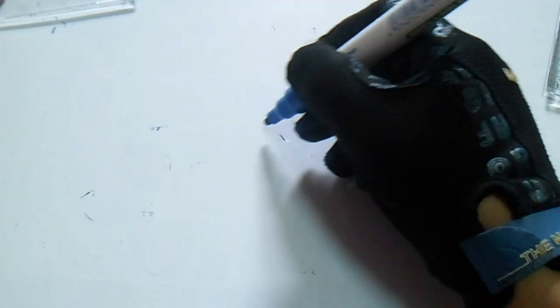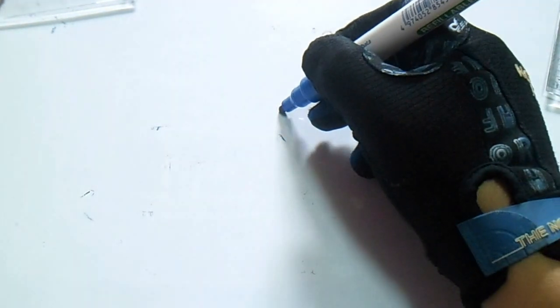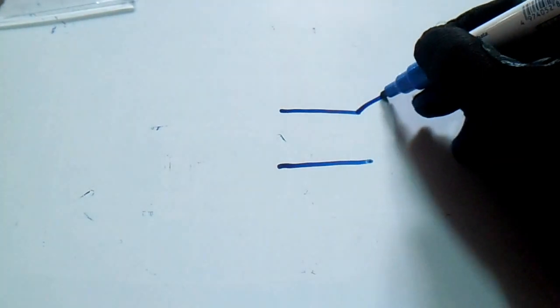If we have a flange, the alignment is very accurate. Sometimes you have only 1 mm or zero mm tolerance for the alignment of the holes, because this is important when attaching from the front — zero tolerance. Now, if we have a pipe with a flange here and another pipe with another flange, and that one is already welded and already inspected by the piping inspector, we now fit up this flange to flange.